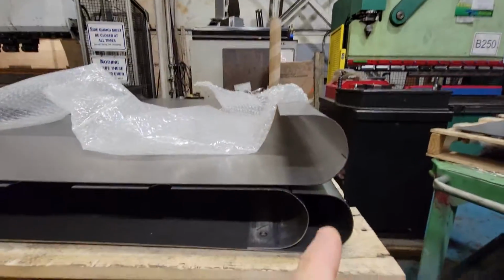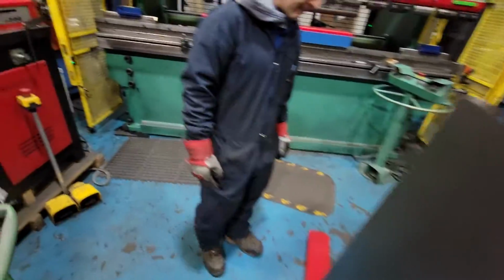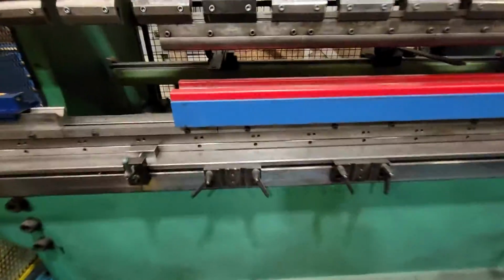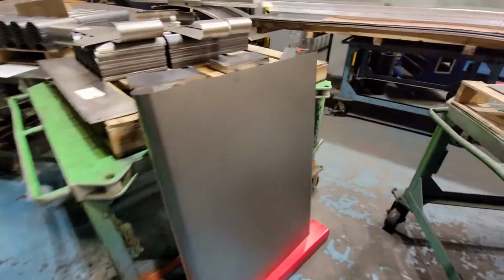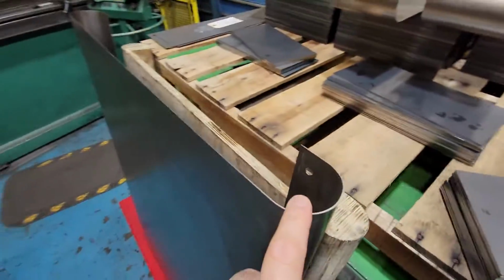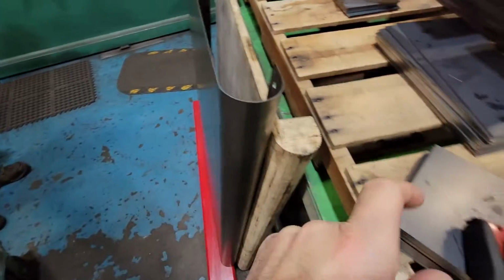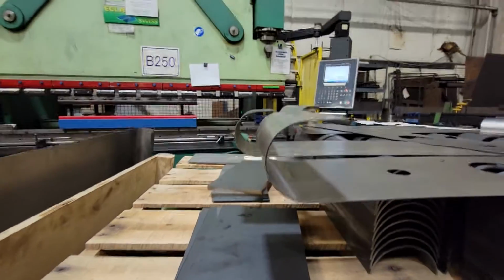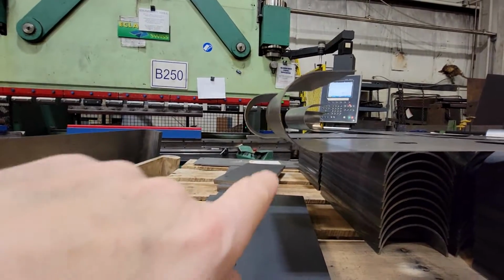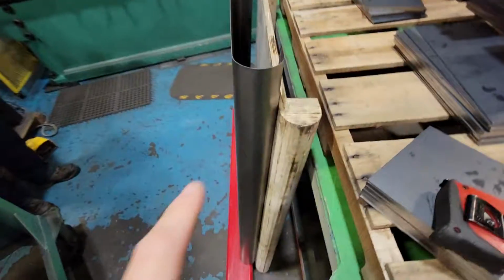But when we try and fix it, again, I'll show you the dies we're using, especially the urethane dies. When we try and fix it, sorry, Danny, this is a perfect radius. Material does have some spring back. So we did this one here. We tried to make the radius absolutely perfect, like the sample. The sample, being as narrow as it is, tends to be perfect, but I do see a flat spot here, but not as apparent as on the full-size parts.